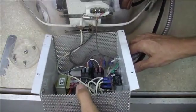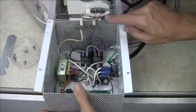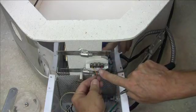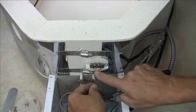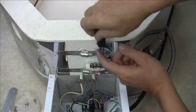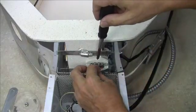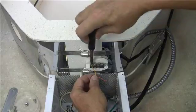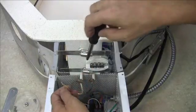There's not a lot of play here because of all the wires attached, so I'm going to take these two wires off which are attached to the thermocouple. The red one is on the right-hand side and the yellow one is on the left-hand side. All I have to do is loosen the screw a couple of turns and that wire comes right out. Do the same with the yellow side — loosen it off a couple of turns and pull that yellow wire out.